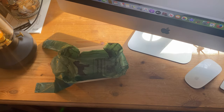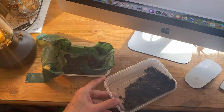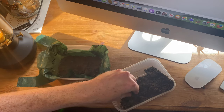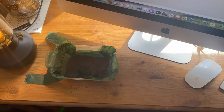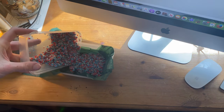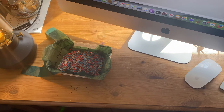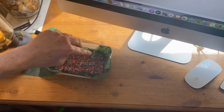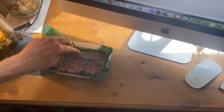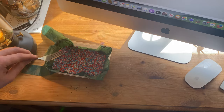All right, and then the next idea is to put a layer of sand on top of the damp proof membrane, obviously not letting it leak in like that. So we put a layer of sand down and flatten that down, not too much. And then finally, over the top, represented by this old fish pond stuff, we're going to put in some gravel to bring it up to ground level. And then with a rake, we're going to get it level. And that is the plan, which is, I think, a cheaper and better alternative to concrete to get the foundation sorted.